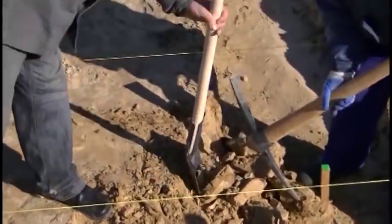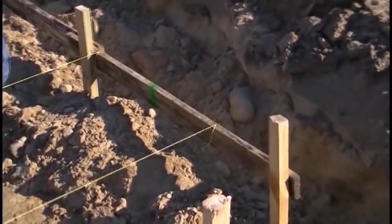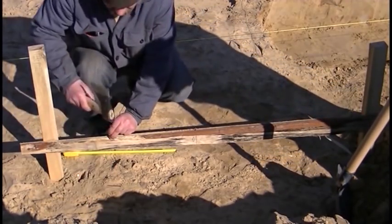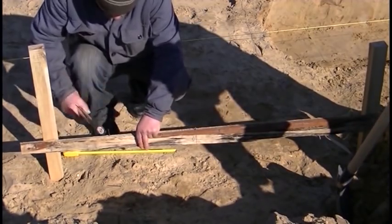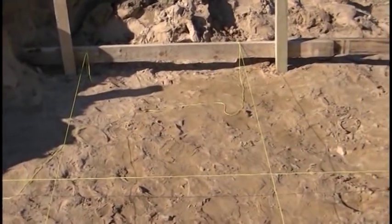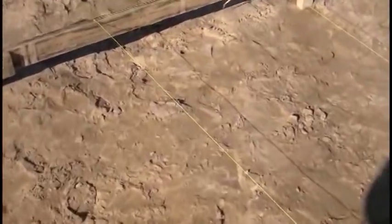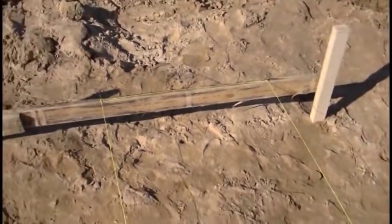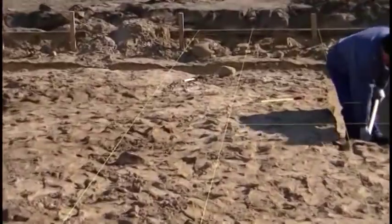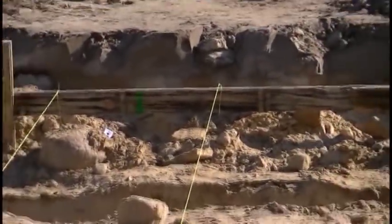We will dig quite a wide pit since the profile boards themselves will be made as formwork, so we need space to perform carpentry works. As for determining the depth of the pit, all boards of the profile boards are attached at exactly the same level — thus all the ropes are located at exactly the same level as well. This level is known to us, described by the surveyor and expressed in meters above sea level. The level of founding the building is described in the building permit design and is also expressed in meters above sea level. Once we have those two levels it is enough to subtract one from the other to find the depth at which the bottom of the pit will be located, measured from the rope. Please note that we are digging the pit while the soil is still a little bit frozen.